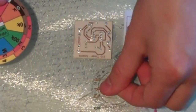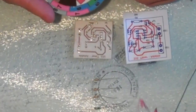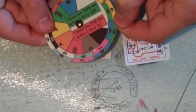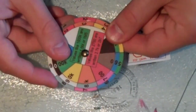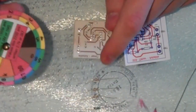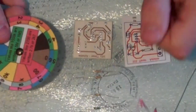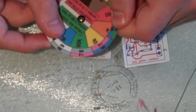The metal film resistor has a red tolerance band, but for the purpose of this it doesn't really matter. So the first band we can see is green — that's five on the outer wheel of the resistor colour code calculator. The second is blue — that's six, so we just spin it around to six. And the third is brown, so we spin the middle wheel to brown and that gives us 560. So that means that resistor is 560 ohms, and that one's the same so that must also be 560. The next one is green, blue, yellow — green, blue and spin it to yellow.